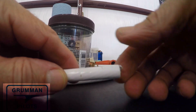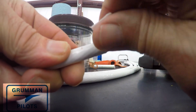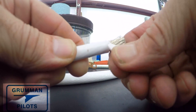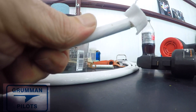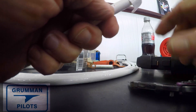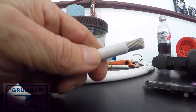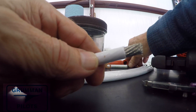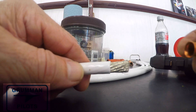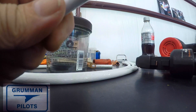After it's been scored around very carefully, you roll it on a hard surface. Again, you don't want to cut down and break a strand. Then you score a slit in the same direction as the cable runs, and now you're ready to go ahead and get the end completely off — all the time not cutting any strands. Broken strands don't do you any good through the whole cable. As a good craftsman, we try to make them all as best as we can.